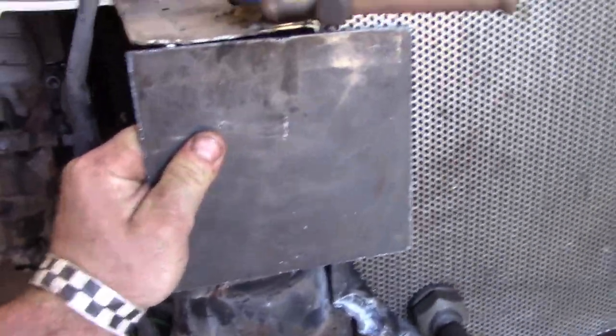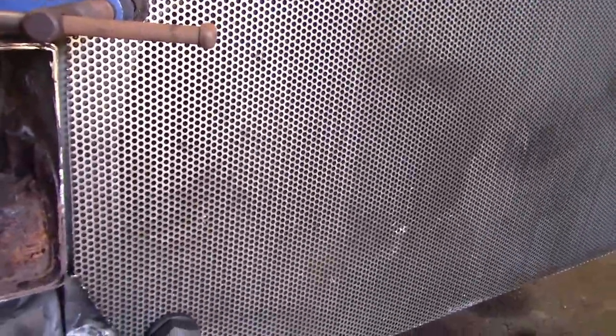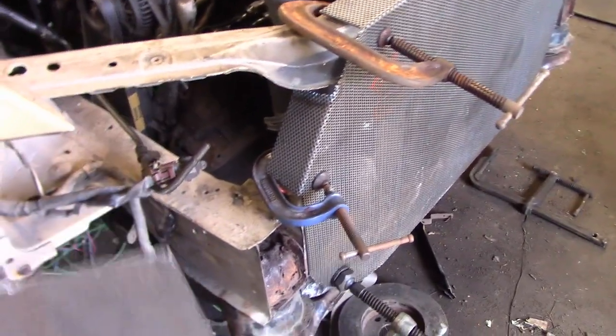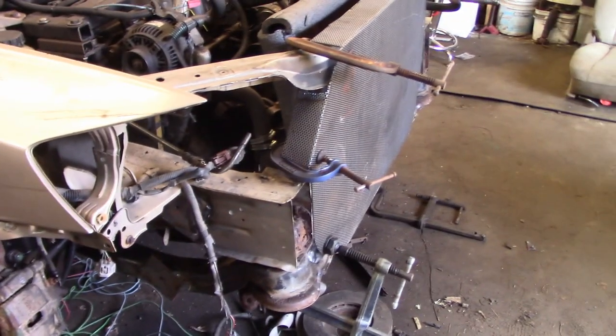I got these cut, and I'm going to cap these on here like this. Last year my issue was I didn't put the mesh in before I put the bumper on, and this year I cut everything back too much so now the mesh bows out past the bumper. We're going to put these spacers to hold the mesh, which gives us a quarter-inch spacer for the bumper. Then we'll pull the bumper on with ratchet straps and a come-along to the suspension so it's all up on there.